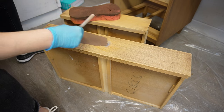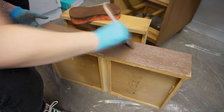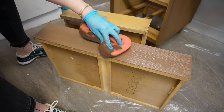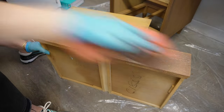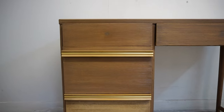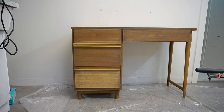Here I'm applying the chocolate paint wash onto the front drawer — wiping it on with the chip brush and then using the large sponge to wipe it back. You can see the drawer that has not been washed behind this one, and what a difference! This chocolate wash really warms up the desk and gives it a fantastic look. I finished all the rest of the drawers with the wash including the body, and you can see the difference between the drawers that have been done and the bottom drawer that has not.